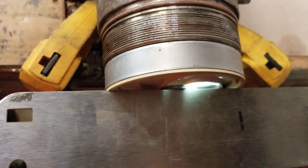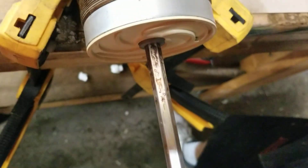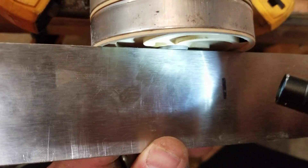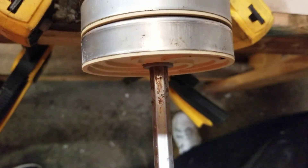You can see it's a nice tight fit. If I put the light up underneath, you can see there's no light in between there — it's a nice tight fit. Then I go to the next one: I put the impeller in there, snap the diffuser on the outside, put it together, and continue right down the line to see if they meet tight. If there's a little bit of play or a little bit of a gap, we'll do another one here.